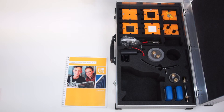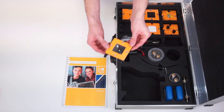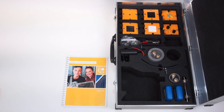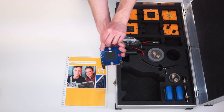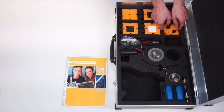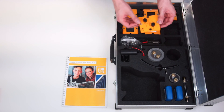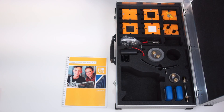For basic experiments you will find a Fresnel lens and two absorber plates. With the Fresnel lens the increase in the efficiency of a solar collector can be illustrated. The two absorber plates are provided on one side with a black layer and on the other side with a light layer. When using the Fresnel lens the module with the small opening is suitable. There is a motor module and a potentiometer module available as consumers. With the potentiometer module it is possible to control the voltage to the pump via a voltage divider circuit and hence continuously regulate the pumping rate.